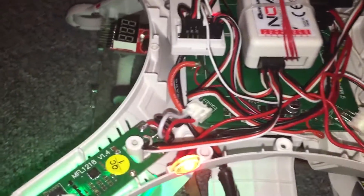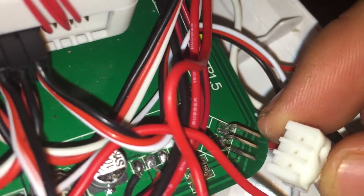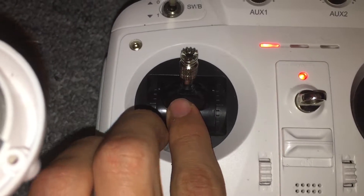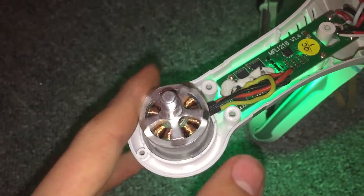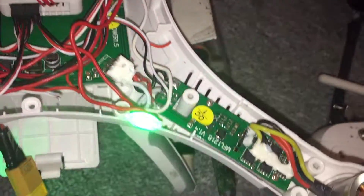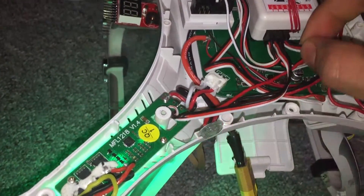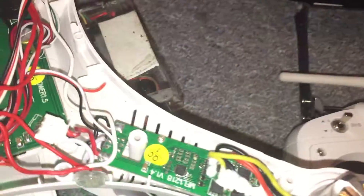What you need to do now is find the connector for the motor. After you unlock your motors, all you need to do is push the throttle to the top position — as high as it'll go — and this motor will spin at full throttle. When it's spinning at full throttle, plug this ESC in and you will hear two beeps, then put the throttle all the way down and you'll hear the ESC initialise as this one did. This is calibrating the throttle through the flight controller and through the receiver. I'll do a demonstration of how you do this.